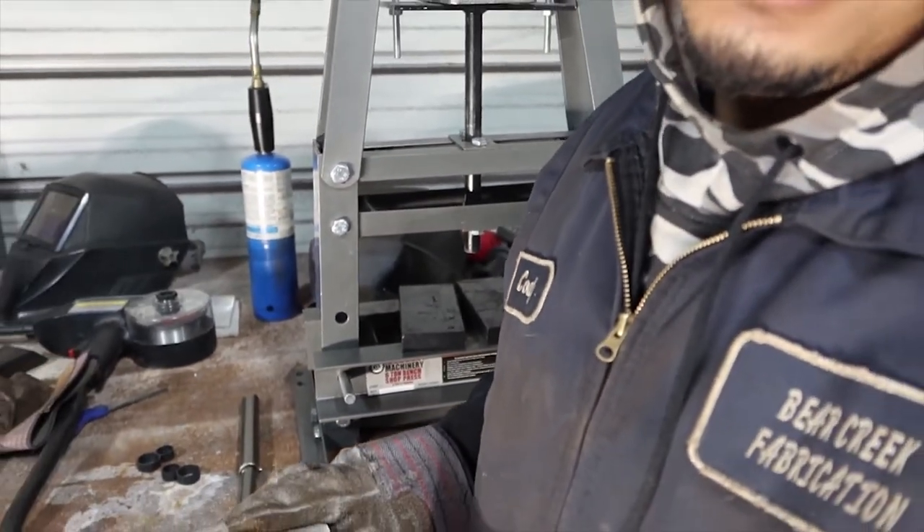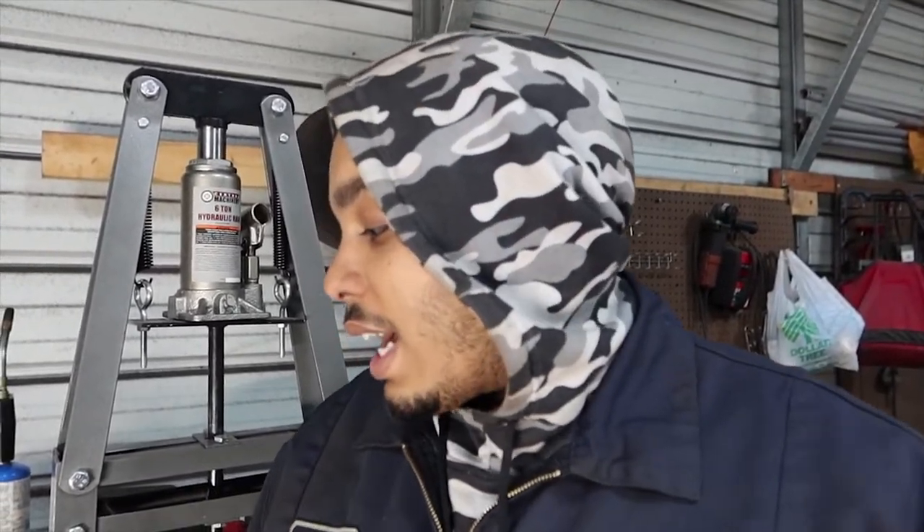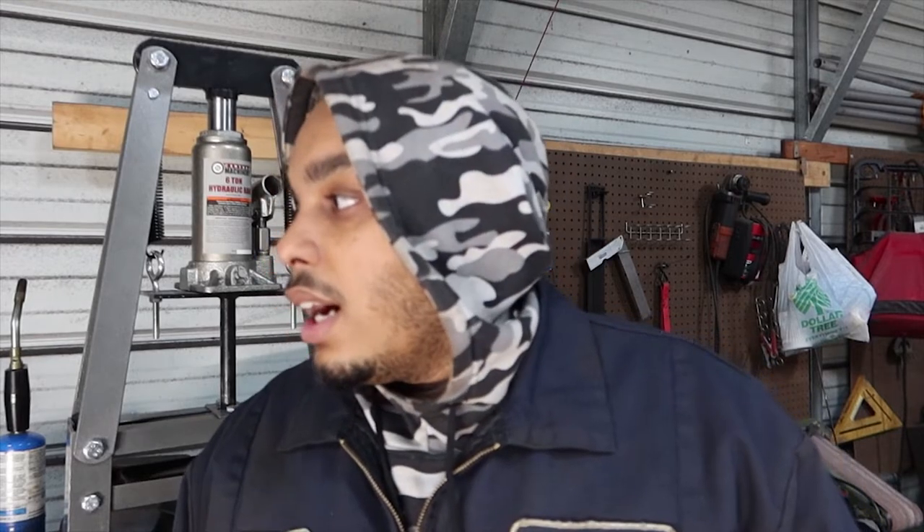This is a good machine — I still have it and I stand by it. The only downside is it's analog, which is not a problem as long as you can get it set right. If you're a weekend welder you just have to play with it, but with more experience you can set it properly. Preheat anything over a quarter-inch, definitely. The MIG gun is fine — I just wouldn't run flux core through it because after a while it gets clogged and you have to change the liner. The major downside is it is way too heavy.